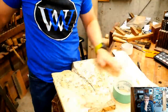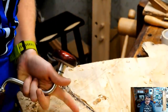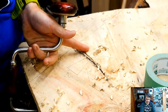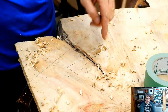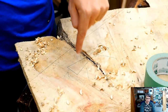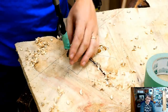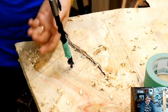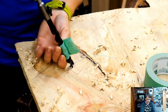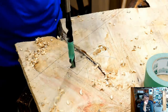In other words, focus on this. Normally the wood grain is going across the dovetail, so I want to have a whole string of holes going across, severing all these fibers going through. It just makes it easier to chisel when those fibers are severed. It's not just about removing waste, it's about cutting the fibers so that you can chisel them out easier. Any questions on doing this?